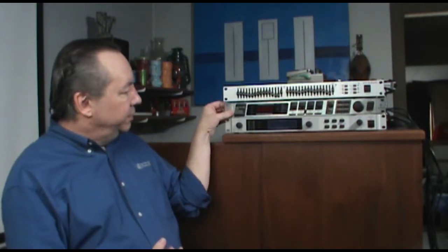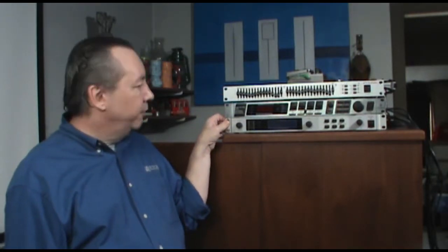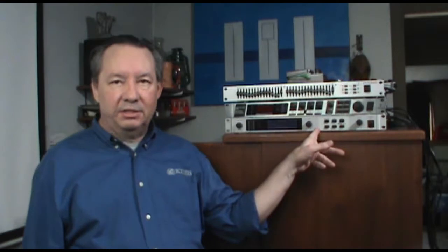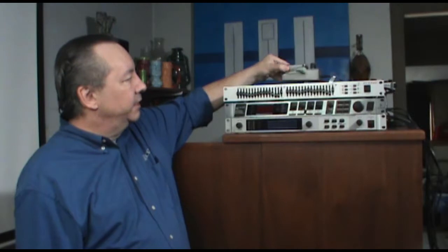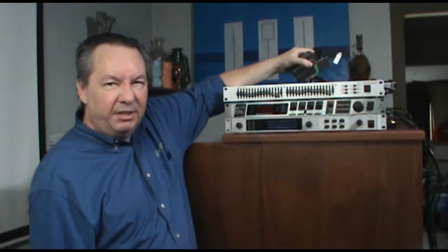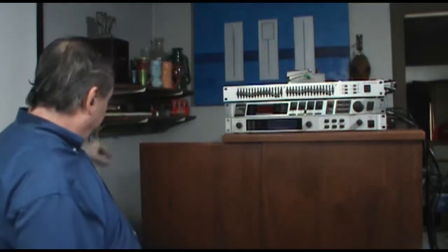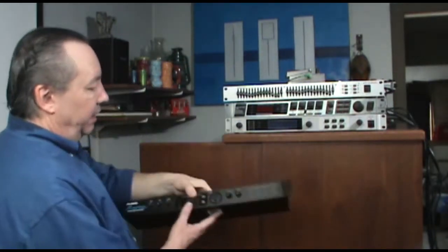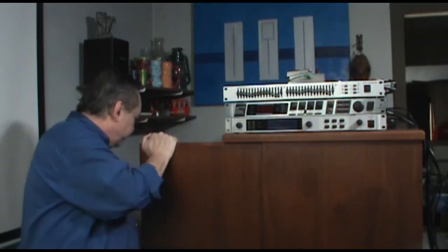This is all on the two main channels of the organ. Then we also go through this reverb device. Now by running the reed on a separate channel output, I'm not going to be able to go through this reverb system, and I don't want it pitch shifted. So my solution, I'm going to try out this guitar stomp box reverb unit on the reed channel and see if I can get a good match for the reed channel. And if that doesn't produce satisfactory results, I've got this Alesis effects processor that I can put into that channel to create that.